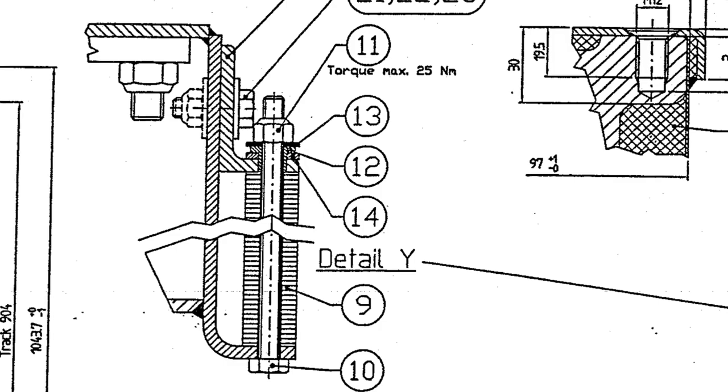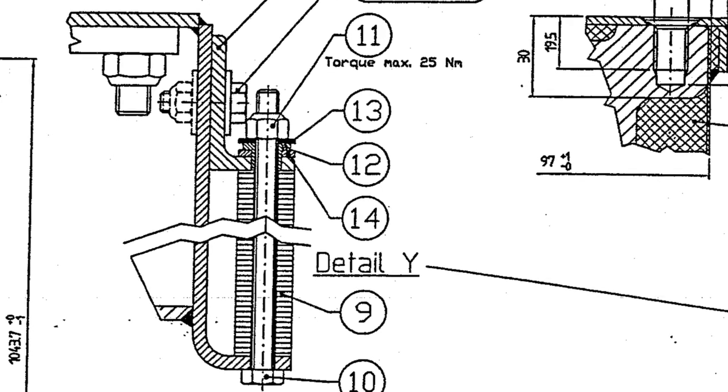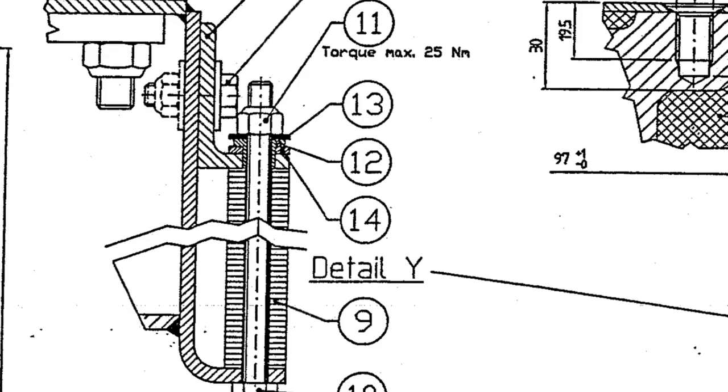To the outside of the stators, there's heavy iron reflectors that are used. The reflectors are designed to basically take the magnetic field that's coming off of that stator and just kind of going everywhere, and it tries to hit that reflector and it can't go past it. So the magnetic field is basically bounced backwards towards that motor, trying to keep that field in that very tight little narrow gap, which is only, I believe, 8 millimeters wide. It's not very wide. It's very small. When the reaction fin is inside there, you can barely fit a credit card on either side of that fin.